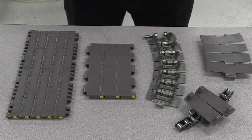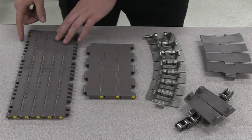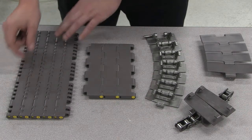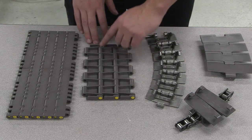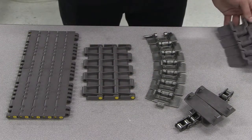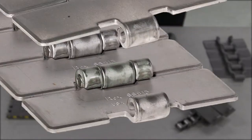There are two general types of chains: tabletop and mat top. Mat top chains have a modular design in which individual links are bricked together to provide a continuous surface. They also include a pin that extends the full width of the chain. Tabletop chains have a fixed width design; links are held together by a pin that does not run the full width of the chain. The pin acts as a hinge that is centered on the chain.